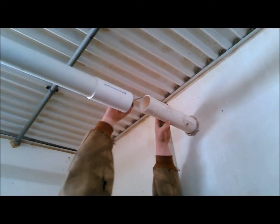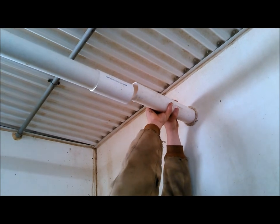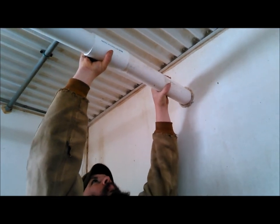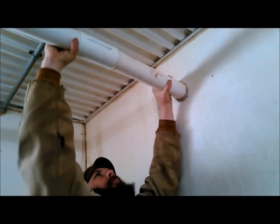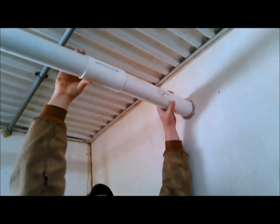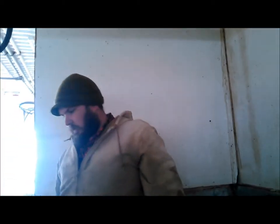That curve, we don't use glue on the outside. Actually, the tension of the auger will hold it together. And I didn't use glue on the outside because of the angles on them bends and them elbows. That's like a 22 and a half degree elbow out there. If you don't glue it at the exact right twist and angle, you put a lot of tension against the auger, and that flex auger will wear way faster. And if you actually leave it loose, it has an opportunity to twist into the perfect shape. And if it's glued, it can't twist with the auger.